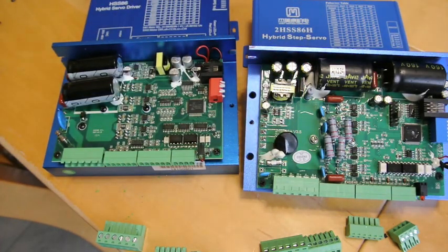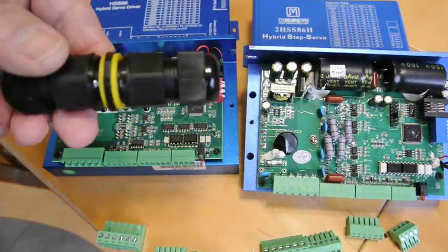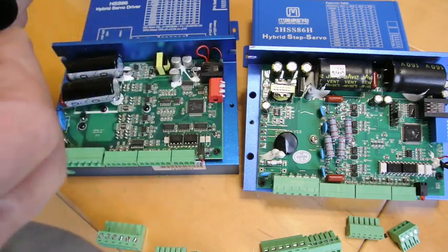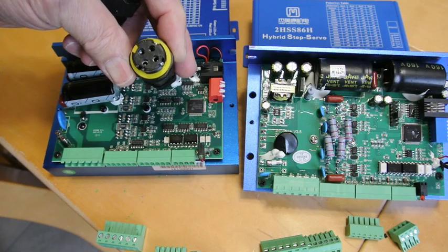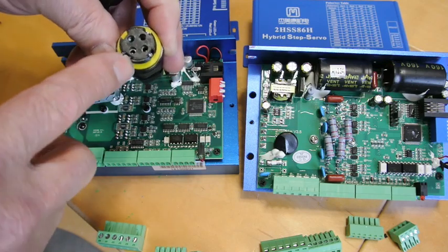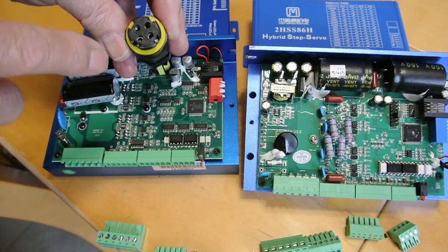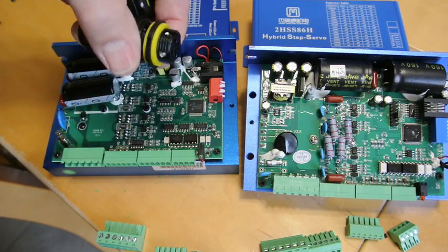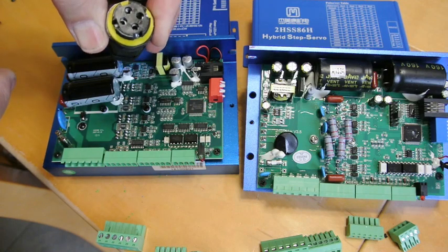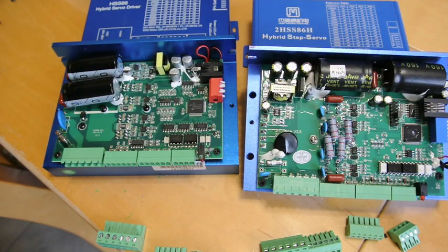The reason I had a short circuit is difficult to believe, but it was using a particular waterproof connector to connect up the short leads coming off the motor. Somehow when the screw was tightened up it caused a short between two points. There was nothing I could see that was touching — I even cut one of these apart to have a look and couldn't see any way it could connect — but it did, and that was what caused the fuse to blow.